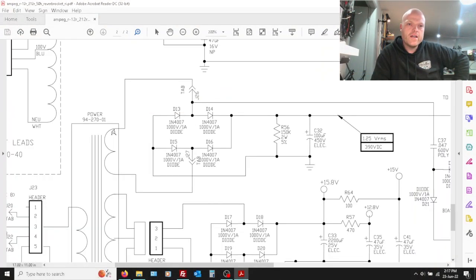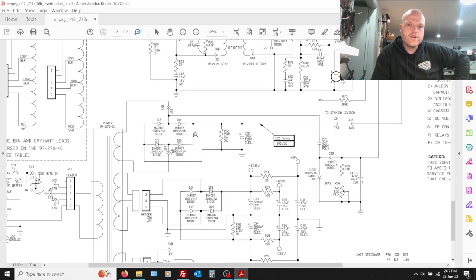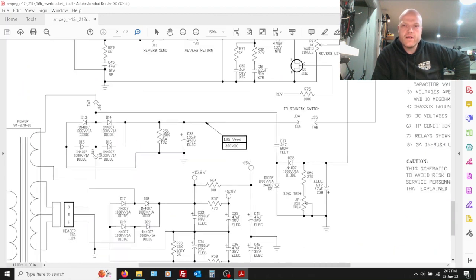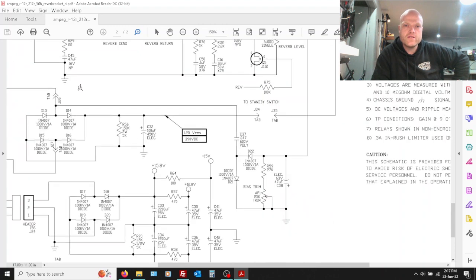So this is our main high tension supply here. It's going through a bridge rectifier. It's got a bleeder resistor to ground and your first filter cap, or reservoir cap, you could say, because it's before the standby switch. It seems to be the common vernacular. There's also your bias supply, which is pulling AC from there,